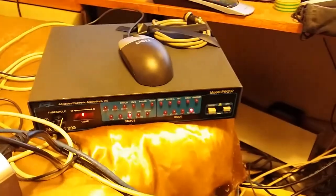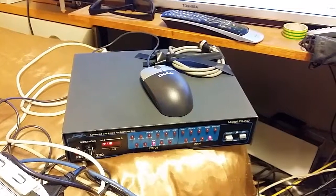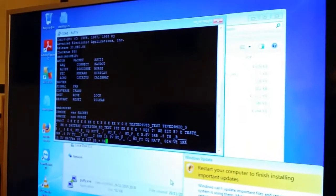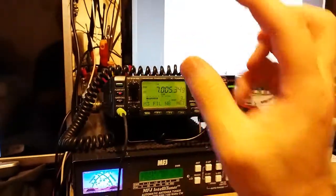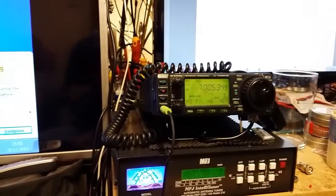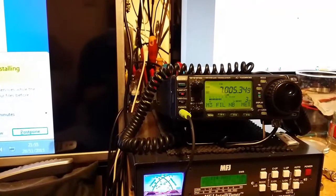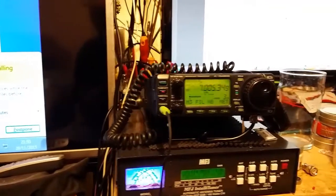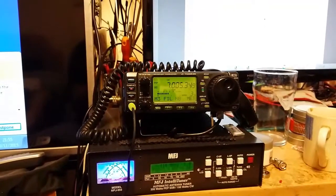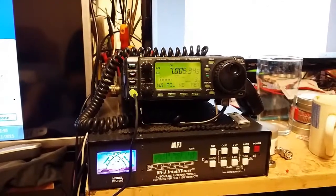But that's how easy it is. It literally took me 5 minutes plugging this into a basic cheap throw-out computer, connecting it with a free software called Putty, connecting it to any old radio, as long as you've got a nice, strong Morse signal, and whoosh. This video has taken 16 minutes, but theoretically, if you weren't trying to film it and explain, this would have been a five-minute setup. For the very first time, I've done this from scratch. I am not an expert. I've only passed my foundation license the other day, and I can see how easy this is.